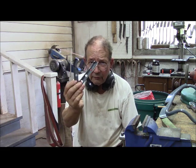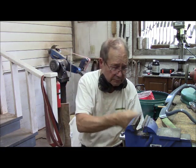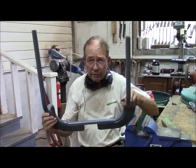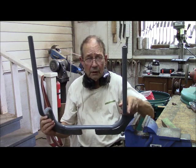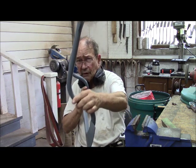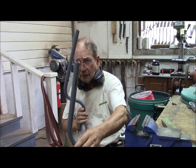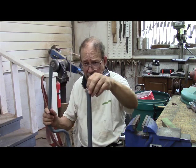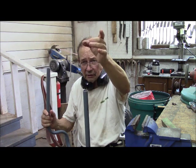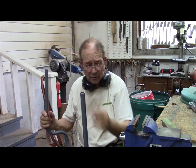My problem is, now that I have these two pieces removed, how do I restore that functionality to the machine? Well, two things present themselves. One is, although this has been cut off, it's also out of line. These two pieces are no longer parallel. All right. This is the piece I've cut off here. I need something that inserts inside, is long enough to connect, and then take a pin right about here somewhere to connect to the control arm.